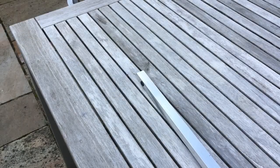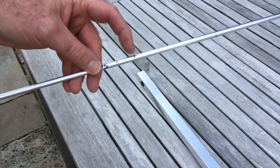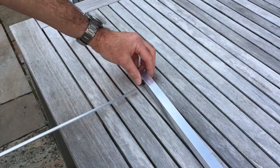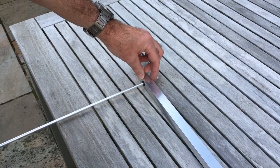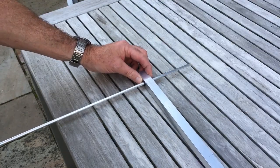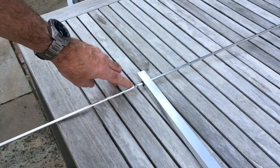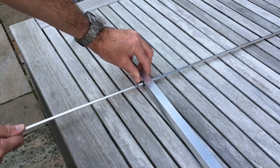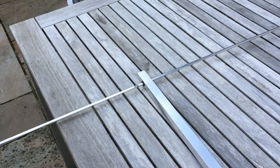With the boom attached together, this is the front of the Yagi where director five goes. You can see director five and the two areas already marked for the limit of the boom — it's just a case of sliding it through. It was a bit tricky getting it through the other side, so I pushed through this side first and then pushed through that side to even them up. You line it up, the two marks show you where to push it to, and it's as simple as that.